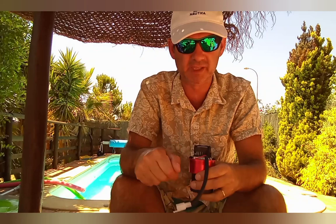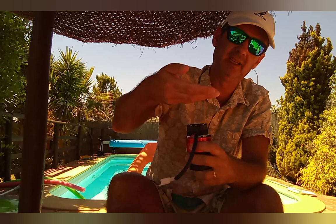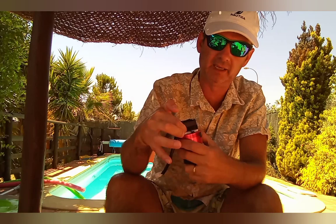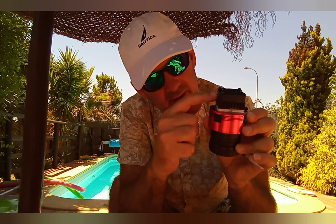You place and center the peltier like this, with the cables on this side. Then you let it dry to stay fixed, but if you want, you can already put more thermal paste on the hot side of the peltier, which is at the top, and then you place the heat sink, just like that. Then you screw the little fan to the heat sink, it came with the screws already. So three objects just like that with thermal paste. Of course, the fan doesn't have thermal paste.